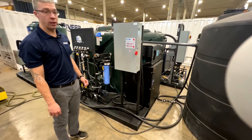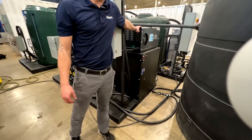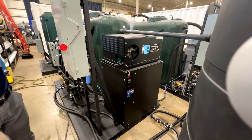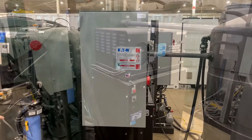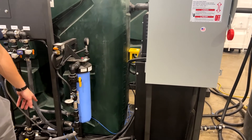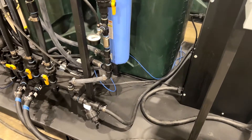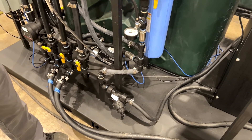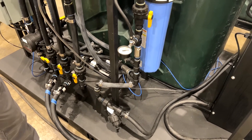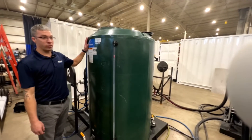Stages 1, 2, and 3 share this pressure washer here. We only use one pressure washer for all delivery. The pressure washer is fed by this big blue filter, which is connected to the pump down below. We filter the water before it goes into the pressure washer so we have small particle sizes and don't sandblast or ruin your parts.